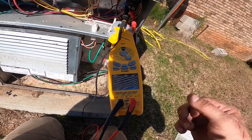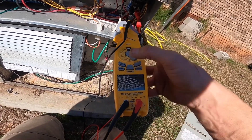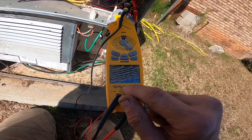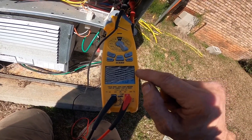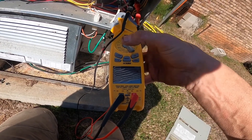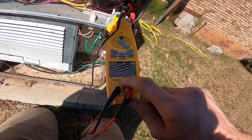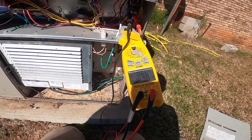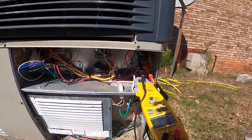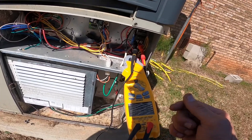Now I'm going to show that picture so you see what I'm talking about. The real amp draw that the power company sees is this. As you see, the volt amps is the same thing as wattage, but with a power factor of 0.66 it's 254. But the real power — which is what's being consumed by this piece of equipment — is right at 100, 150, 170 watts. So there's a difference in the power that the electric company sees this piece of equipment using versus the power that we have normally been able to measure.